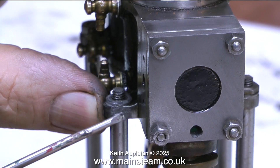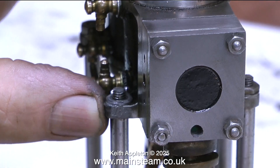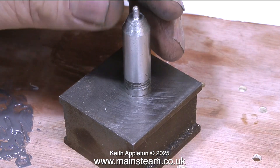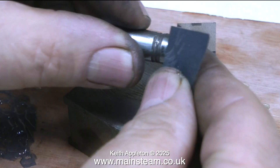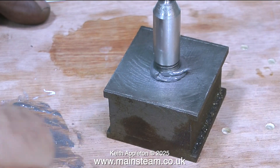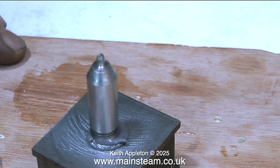I'm using a small screwdriver to spread a little bit more JB Weld on the joint. Since I'm rebuilding this engine for a customer I cannot bash it about to test the strength of the weld, so I'm going to use a couple of scrap pieces of metal and stick them together using the JB Weld left over on the mixing board. Before doing that I'm sanding both parts down with some 400 wet-and-dry paper to give the JB Weld something to key to. I'm not using loads of this stuff — just enough to make a realistic repair.